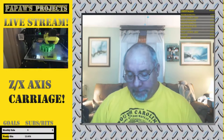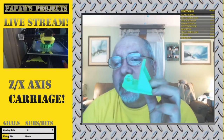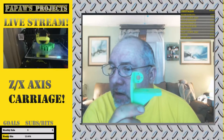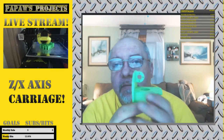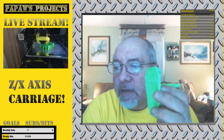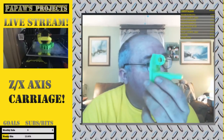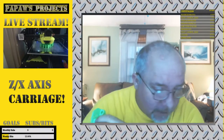That helped me out quite a bit because I was going way too far down the road before saving and then would get past a point of no return. But we got there. The only thing that did not work out with this mount — which isn't a big deal — is to get everything to line up I didn't have enough room for all four screw holes for my lead screw nuts. But I'm just going to either grind or cut a flat on one side. I think three screws will hold that T-nut fine.